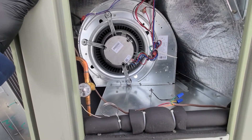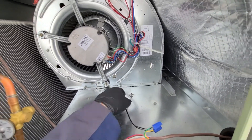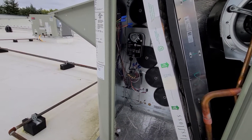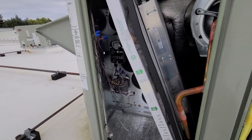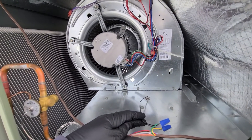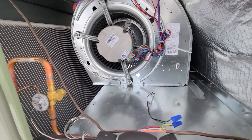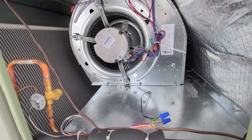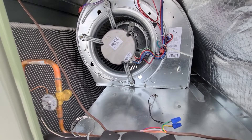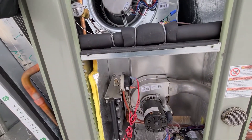This little sensor here is for a different system. Everything I showed you over here is the OEM economizer control stuff, which is really basic and can be a little outdated. This unit has an updated aftermarket economizer control — a good one that you can monitor off-site digitally, pull it up on your phone or computer, check the percentage of the economizer opening, see when it was economizing. It's a lot more elaborate and in-depth.